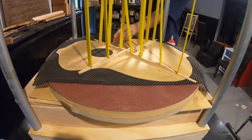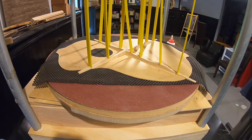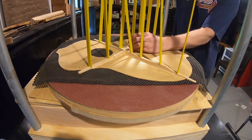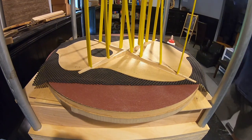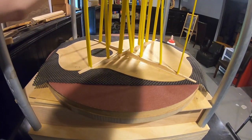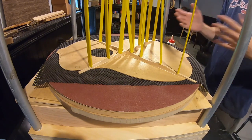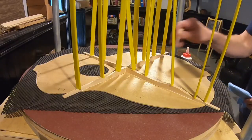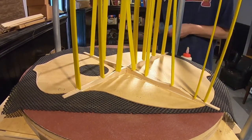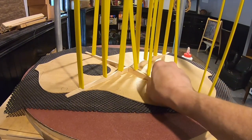I moved the go bar deck into my humidity control room so that I could do this glue-up. I don't want to do a cross-grain glue-up like this in the garage where it's higher humidity. Cross-grain glue-ups like this need to be done in a humidity-controlled environment at around 45–50%, which is kind of right in between the two extremes. Let's go ahead and get this thing cleaned up. I'll finish up with this and see you in a minute.